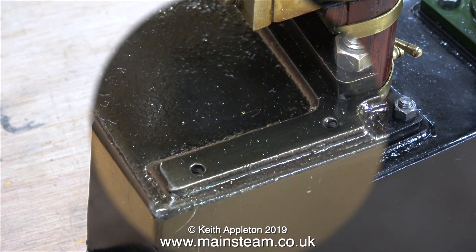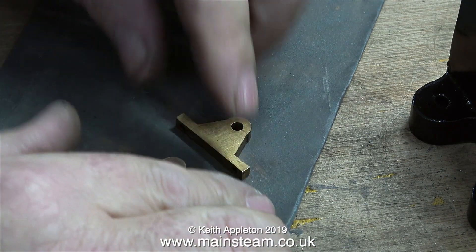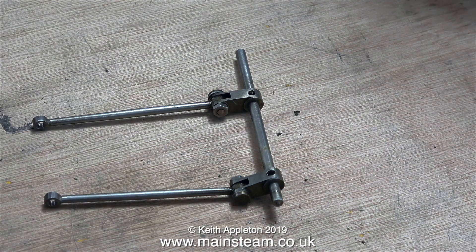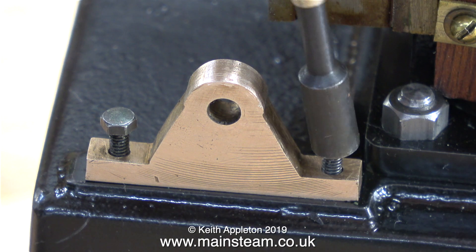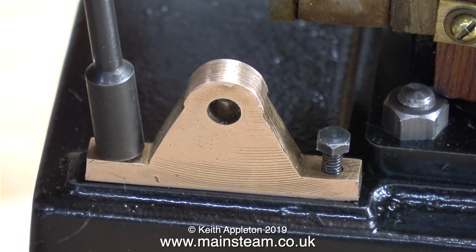The time has come to mount the two bearing blocks which will hold the cross shaft, which in turn holds the linkage that moves the slide valve. I'm using some wet-or-dry sandpaper on these because they are fairly badly marked. This is the main valve linkage — it's a bit grubby and needs cleaning up. I didn't go mad with the sandpaper; the parts are cleaned up but you can still see some machining marks, which isn't an issue. I didn't want to remove too much metal off one side because the bolts would not have been central in the holes.